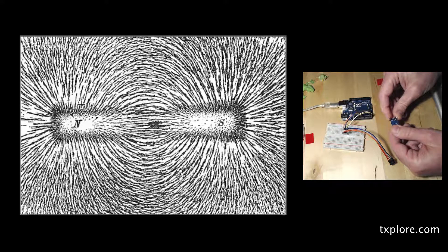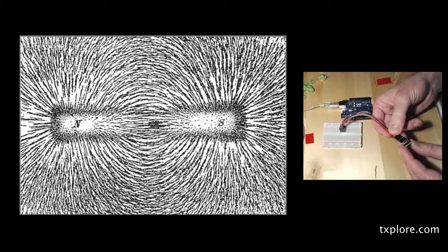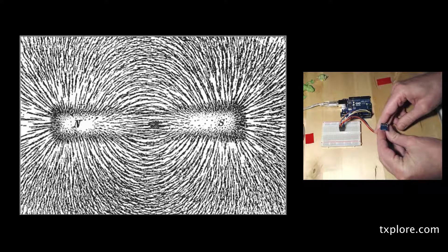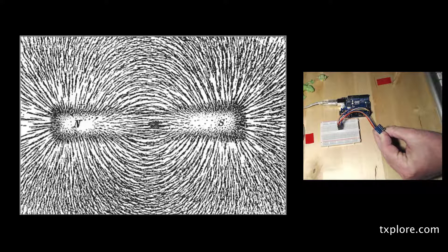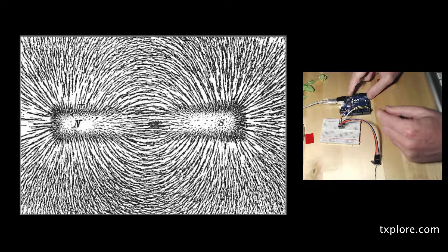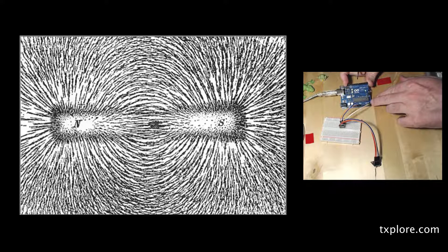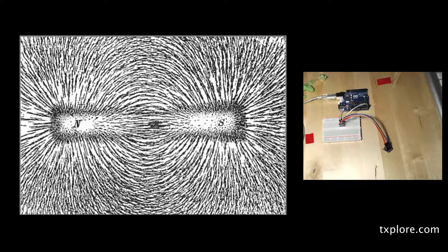So it's pretty accurate as well. I'm going to show you how it works — to do that I will plug it into my breadboard here. As I said, this device uses an I²C interface, so just four wires to do the connection. We use two wires for VCC and ground, and then we've got the SCL and SDA lines as well. On an Arduino Uno, the I²C interface is connected to analog pins 4 and 5. I'm going to have the schematic and the wiring on the website that you can check out later.